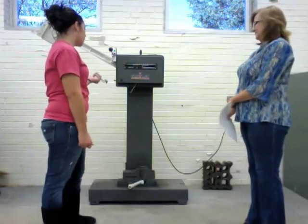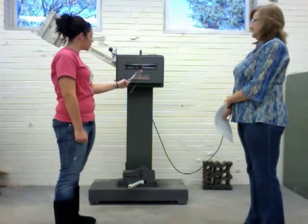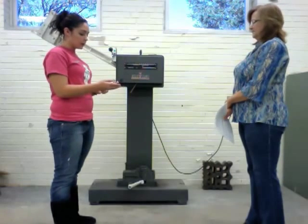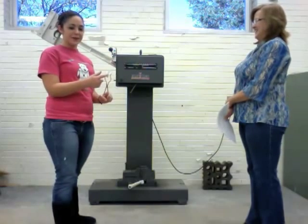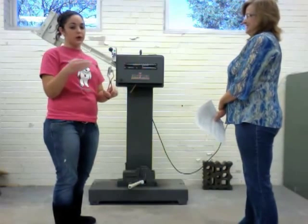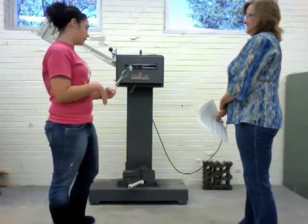You'll notice on the Izod testing machine that the 0 point starts further back than for the Charpy test, which is kind of interesting. So I would just load this carefully. Very carefully. Put it in the notch. You set it in so that it's vertical, and it will hit directly in the middle so that the weight is distributed evenly.